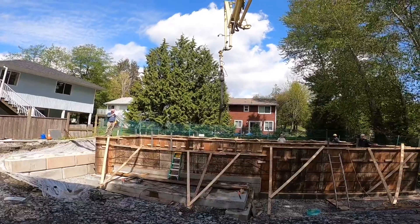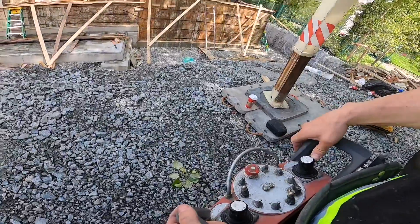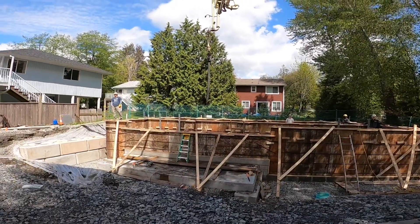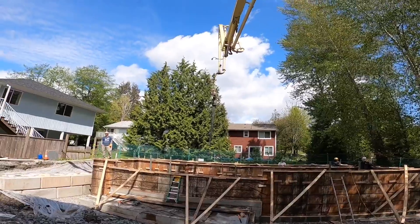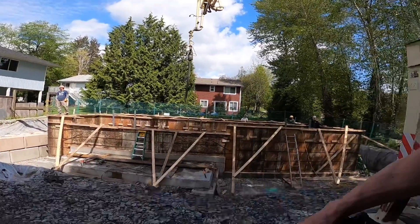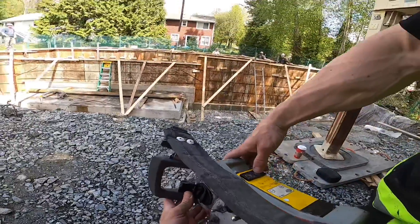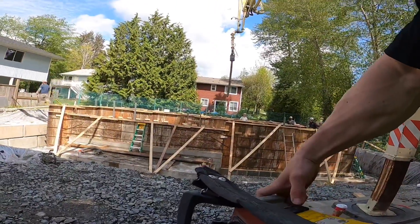Now being that this is just a small boom — a little 24 meter — I would like it to be a little bit quicker on the slewing than say like a 47 or 58 meter pump. So this is decent. I'll do the rest of this by eye, just looking at the end of the boom here. I'm going to do some taps to speed it up — one, two, three, four, five.